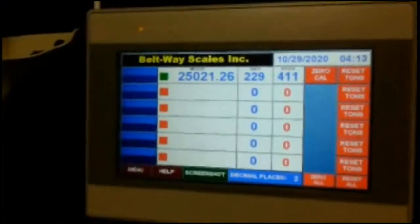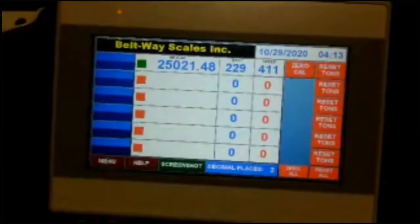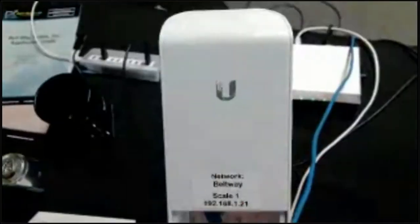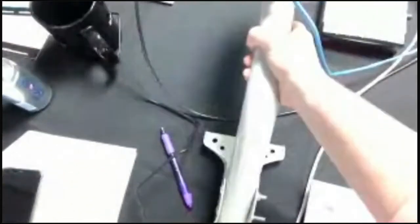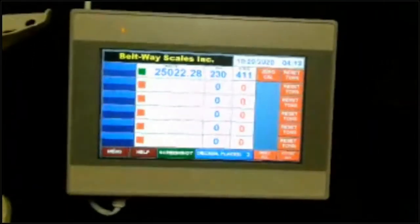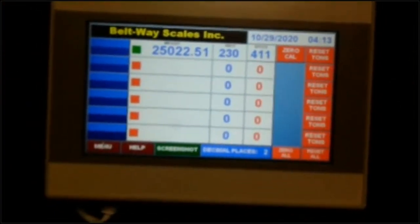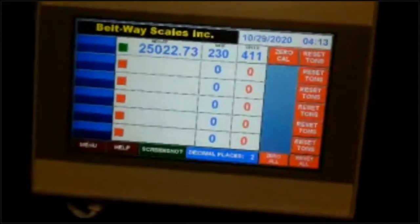Usually this is going to be wireless. You can run CAT5 cables throughout the plant but it's so much easier to just do it wireless. We've got a little wireless setup here where you stick this little bracket on the side of the conveyor, run one CAT5 cable into the integrator, and you're off and running. You've got an access point up in the tower that will talk to any number of scales out there. Plug it into the remote display and you're all set — the installation process is so much easier than running a bunch of cables.